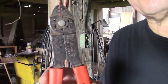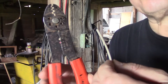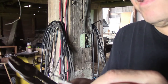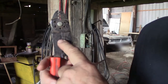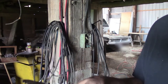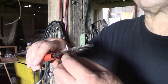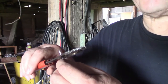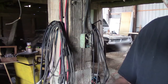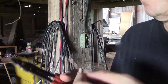It's kind of difficult to see, but there are numbers on here, and it's going to tell you which number to use for your wire. Try one of the bigger ones first. I'm going to try the third one down, which would be from this point down to here — the third one. I want this wire to wrap around the screw, so I'm going to have to go about five eighths of an inch. There you go, I stripped it, and that was the right number.